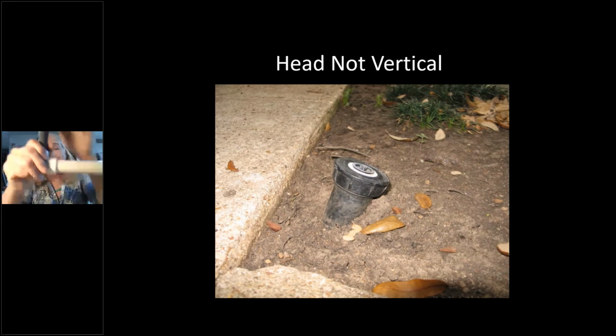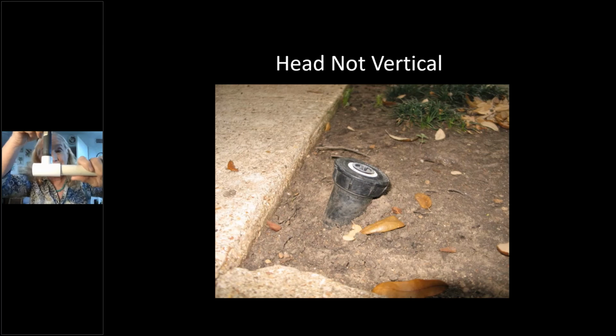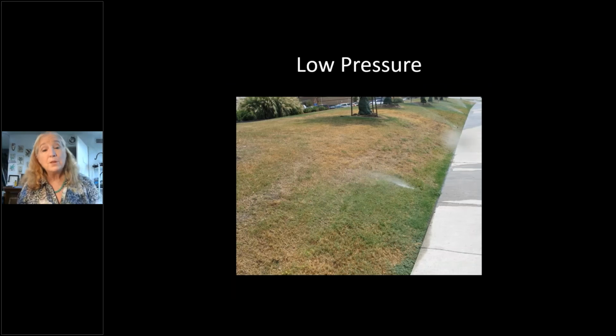And so if we pull this back and this breaks the seal, there is a PVC pipe cement called blue glue, and it is easy to put your wiper with that glue and brush it this way to get it into that seal. I'm not guaranteeing this is going to work, but I fixed many of them by doing that. Of course, this is threaded, and you don't need to worry about that, but it's a possibility that that seal could break. Doesn't always, and this is such a little slant. I bet if you dug that soil out, filled it up, put your soil back down, that's going to correct it. But I just wanted to warn you about the seal there.